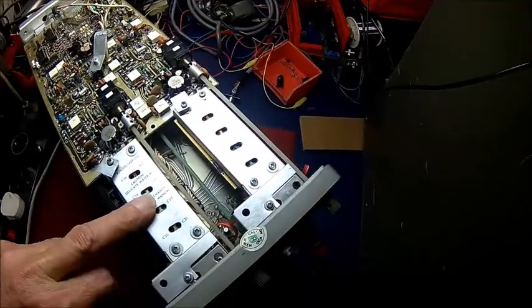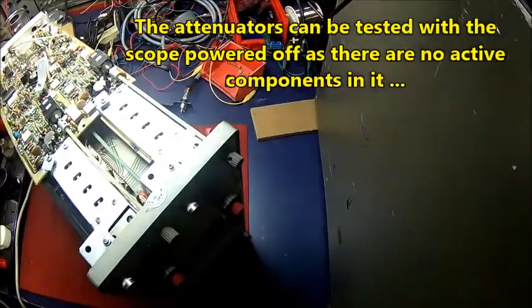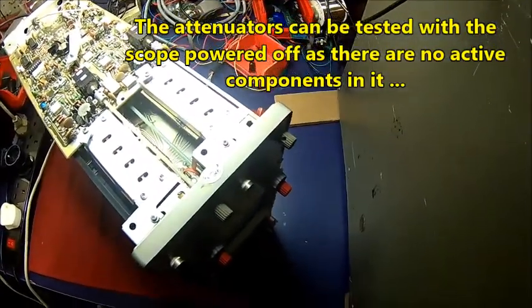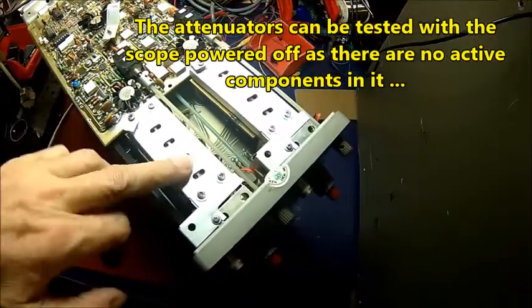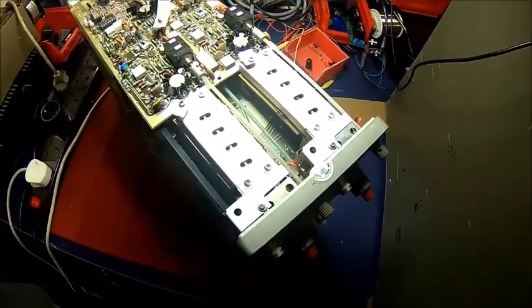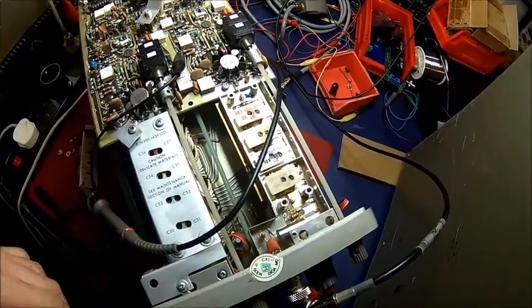I think we take the covers off and have a quick look. I can't see any signal coming out — I was feeding a 0.5V peak-to-peak square wave and nothing came out at the back. Let me take the cover off. Starts with channel 1, because they're both not working.